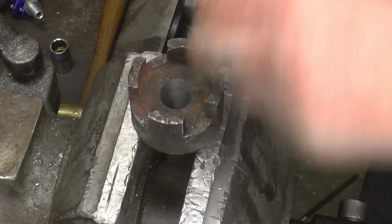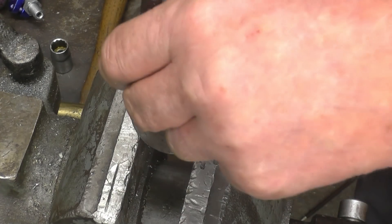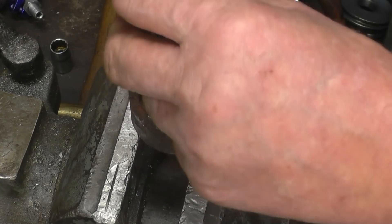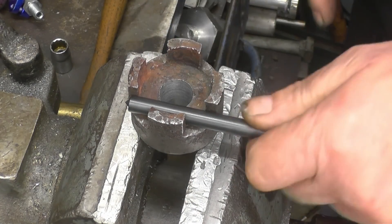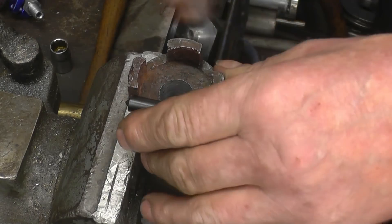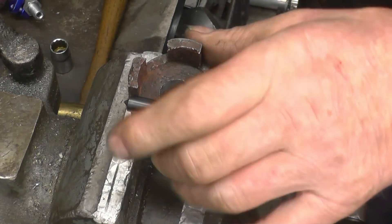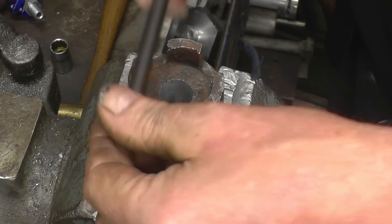You need a little cutter straight across there, straight across there — there's 4. We'll have to work out where the cutter starts, but that shouldn't be too difficult. We need to get a measurement from the centre of there to the centre of there. I'm going to put the dividing head on the milling machine and use that to cut the 4 flats.